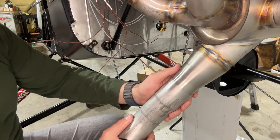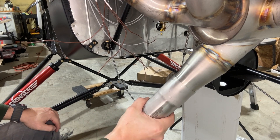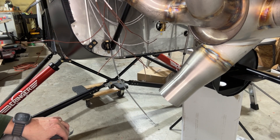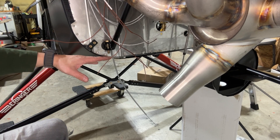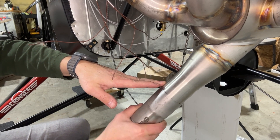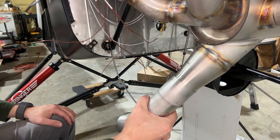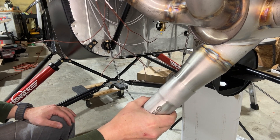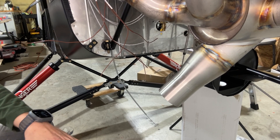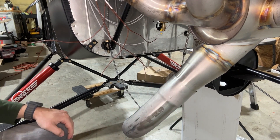This new fancy style fits really nicely and the length looks about right. You probably can't get away with running it straight like that because the cowl is going to come right there and that might be tight — especially with a fiberglass cowl putting out heat. It's really only about a 6-7 inch section, so you'd put a fork there and direct it so you're not getting fumes on the gear legs or in the cockpit. The last one came out too long and you'd end up having to cut it down — this length is good.